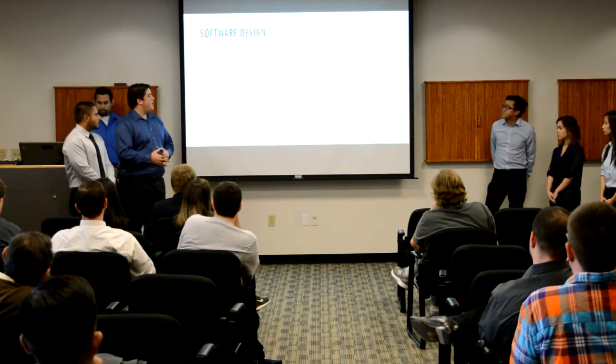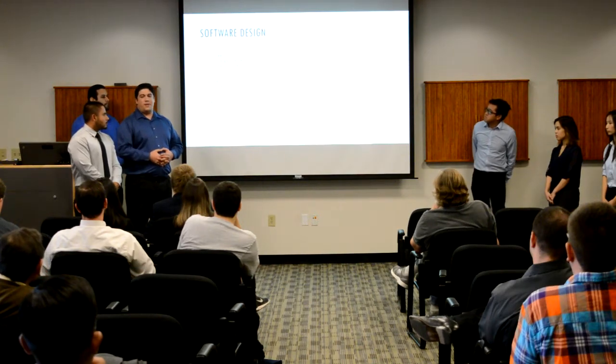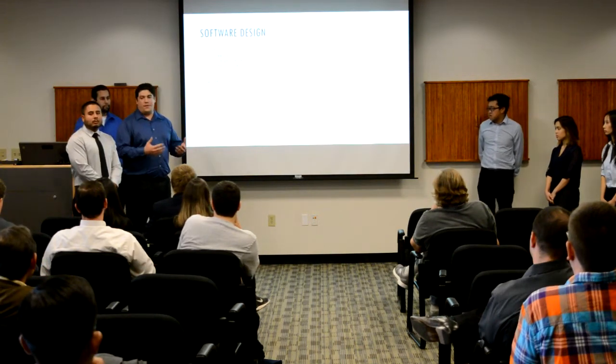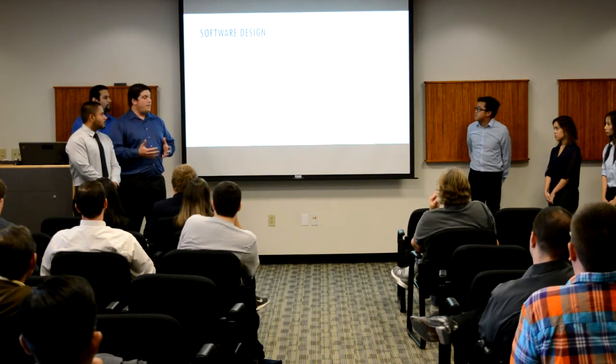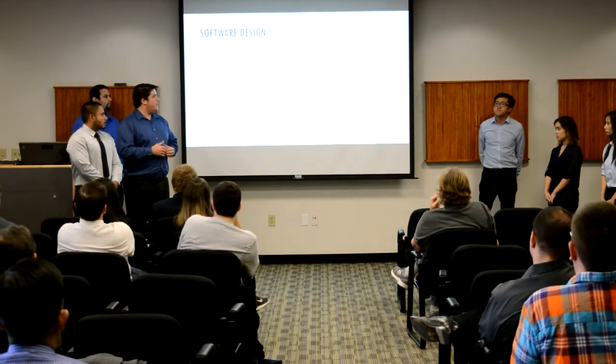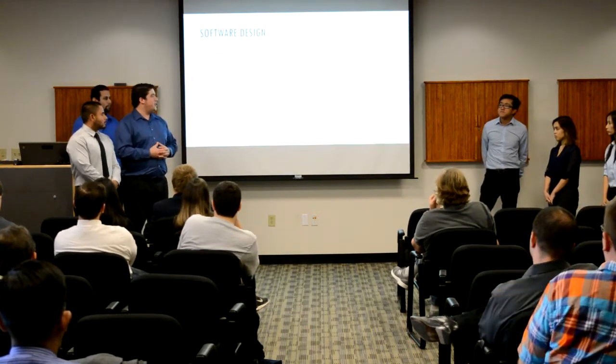So over here on the right-hand side with our sensors, we have the 4 reflectance sensors, and those are going to be our first priority, as we do not want to fall off the edge of the ring, and they also are essentially a kind of a backup to our other sensors. They're our last line of defense. Once we hit the edge, we want to get ourselves away from the edge, back towards the center of the arena.